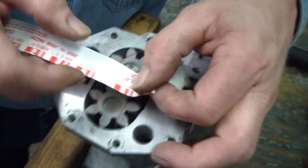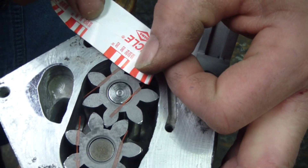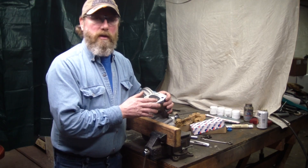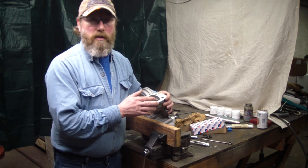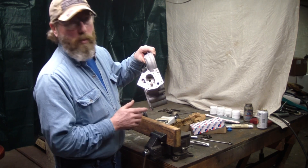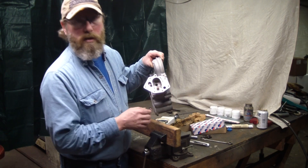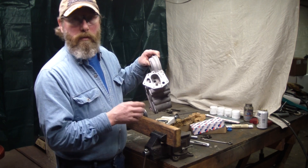We had 0.005 over in this corner, and 0.006 in the far corner. After checking it out with the plastic gauge, he figured out he had 5 thousandths and 6 thousandths. You can see there are machining marks. We have enough room where we can polish this out, get rid of all these scratches, and probably still be within the 2 thousandths minimum that we want.